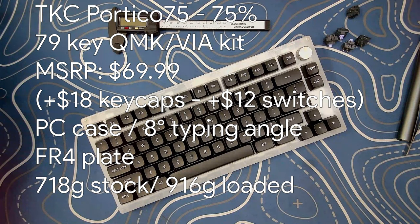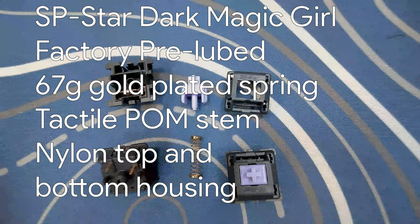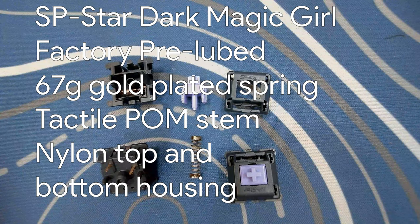It is a polycarbonate case with a set typing angle of 8 degrees. It comes default with an FR4 plate, weighs 718 grams out of the box, and 916 grams with keycaps and switches, as seen here. It has a chin of 21 millimeters with a back of 38.5 millimeters off the typing surface. The switch we are using today is the SP Star Dark Magic Girl. This is a 67 gram tactile switch that comes with a gold-plated spring. It is 5-pin and pre-lubed from the factory. Both the top and bottom housing are made from nylon, and the stem is made from POM.